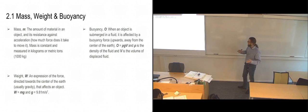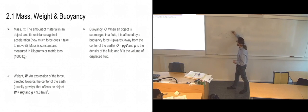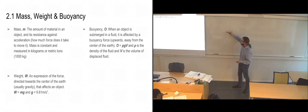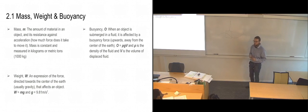And depending on the volume and the buoyant force, if you lower it too fast, or if you have too many waves, you will get your object into the water. And there's the lifting wire. But if you have quite a lot of waves, and you suddenly have waves that cover almost the entire object at least, then the buoyant force that you're getting here might be enough to actually lift the object, which means that you're going to get slack on your wire. And then once the wave passes, the object is just going to drop down. And if it's a blowout preventer of 250 tons, you really don't want that jerking on your line. That's going to snap it completely. Either that or break your crane somehow.